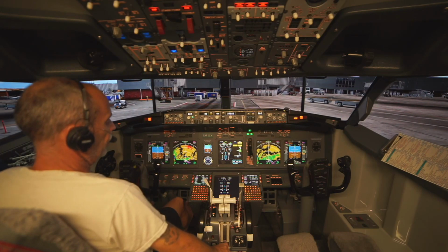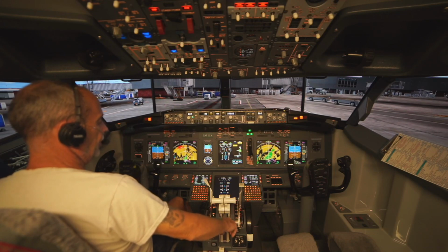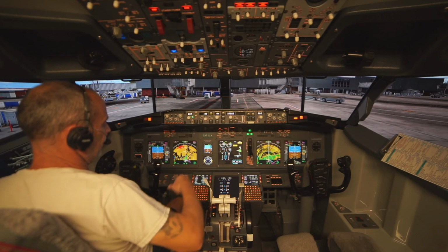So waiting for max motoring. The low oil pressure indicator is going to extinguish, and then we're going to introduce fuel. Normally I'd hold that out in case we had a hot start, but my shoulder's killing me.